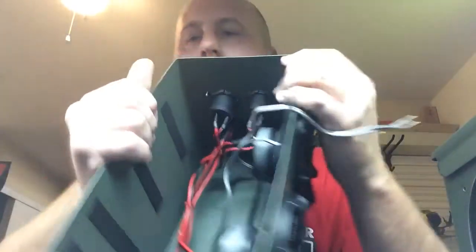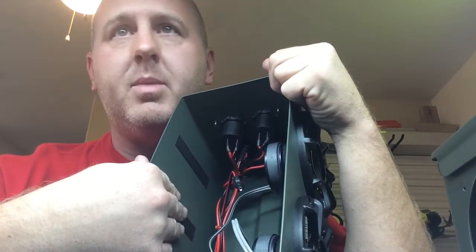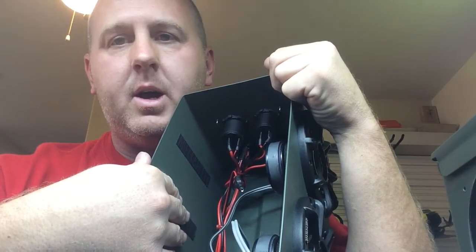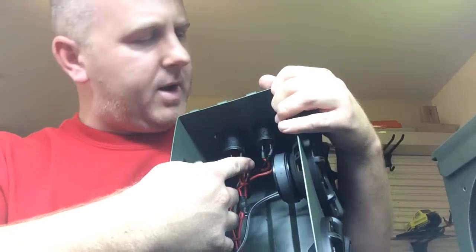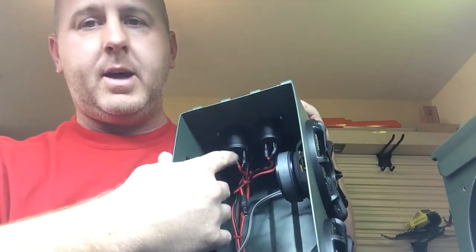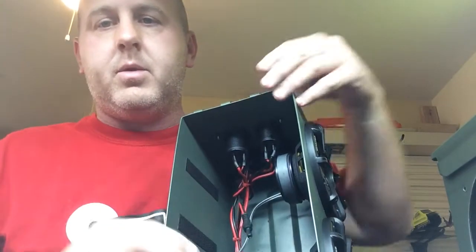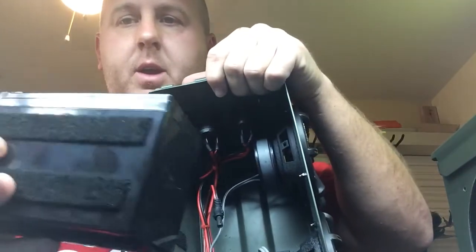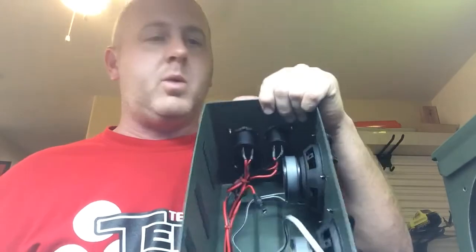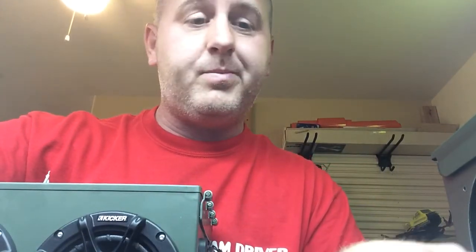Just to peek inside — I'll turn it over so you can see it better. You can see the four-port panel. I pretty much just soldered everything in. If you have basic soldering skills you should be able to handle this. The panel comes with crimped blade connectors if you don't feel comfortable soldering. I soldered in the USB plug and voltage regulator together and piped those into the switch so they'll all be switched. I held the battery in with Velcro, and the amplifier as well — it's very sturdy and hasn't come loose. Anyway, I know I said this would be brief, but we're pushing six minutes, so I'm going to go ahead and shut the video off. I hope this helps some of you.